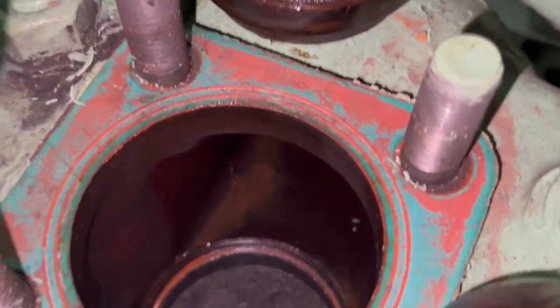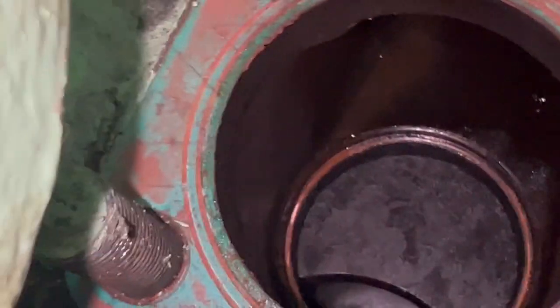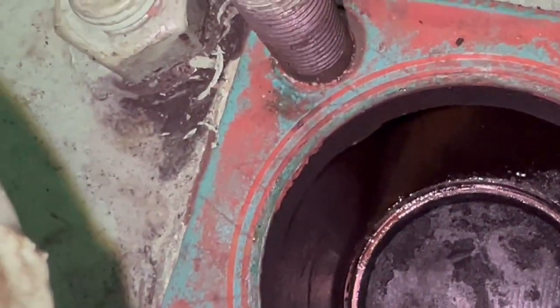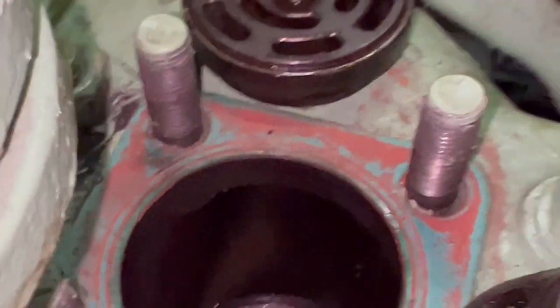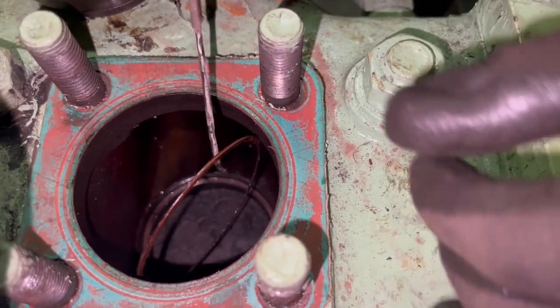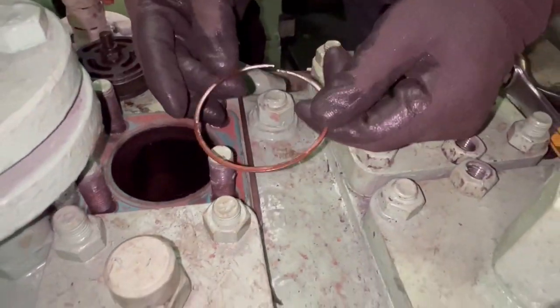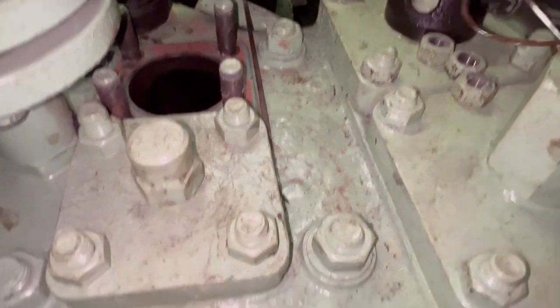This is the high pressure suction valve. You can see the valve is not damaged but there is a lot of carbon deposit on it. You can see the valve seat. The main thing to notice regarding valve positioning is the gasket — you should not forget to fit the gasket. It is seated near the valve seat. I am using a sharpened welding rod to remove it.